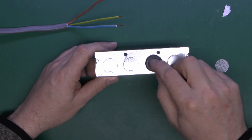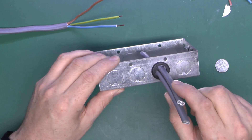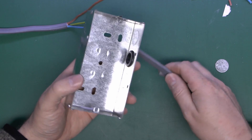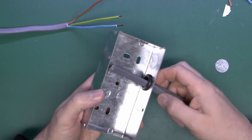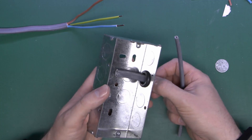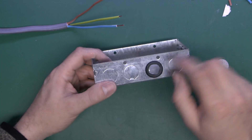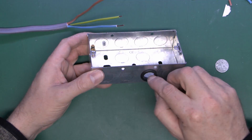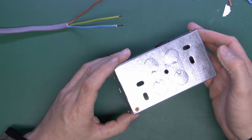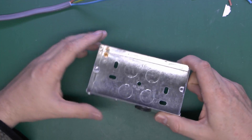If doing a circuit with more than one socket, you'd take out more than one hole so you have more than one cable coming in. These are 20mm holes and in theory you can get two of these cables through one hole, but two is about the maximum. In many cases it's easier to put two holes in so you don't have a fat section of cable that may get in the way inside the box. You can also come in through the back depending on where the cables run in the building.